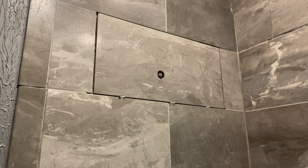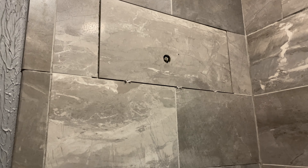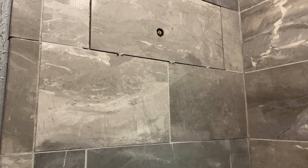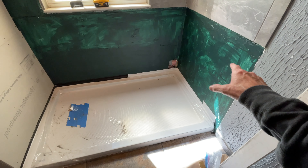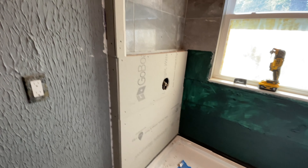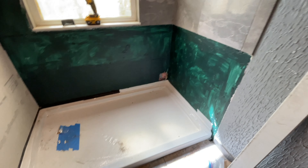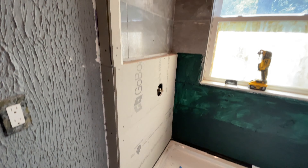I'm going to place that one up there with a hole in it in the shower, and the little hole next to it is going to be for the bracket that holds the spray handle. Waterproofing the wall here — this is a new, very lightweight cement board, fiberglass, good for showers, walls, and ceilings. It had to get bumped out so the door would fit. There's mortar down on that, it's set in place and absolutely level. Now we're just waiting to tile.